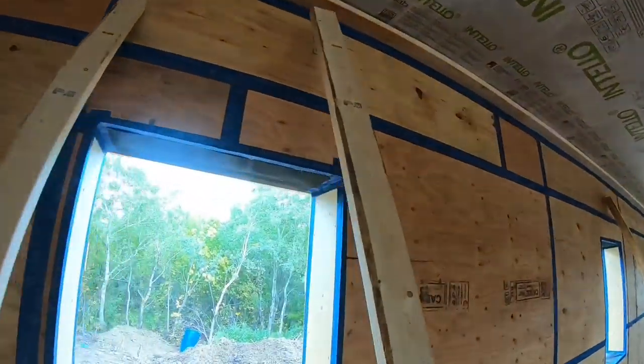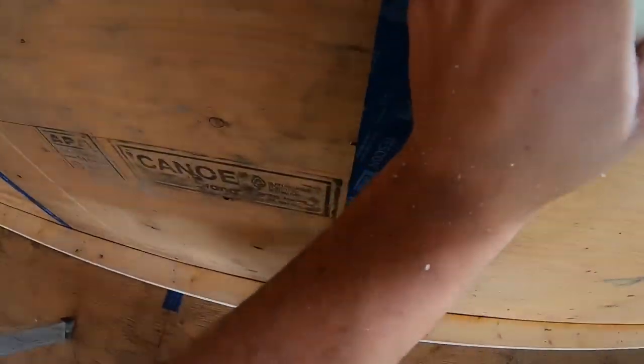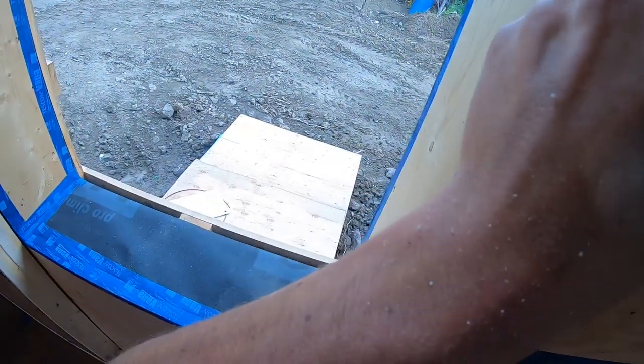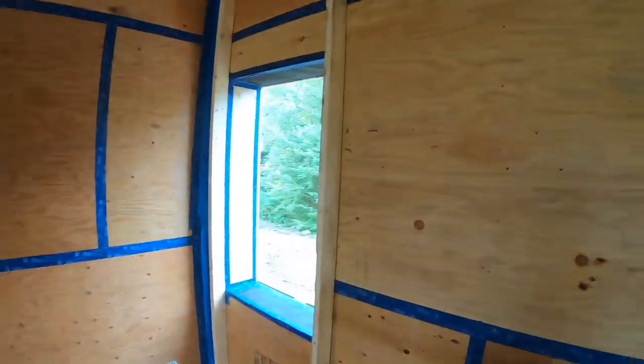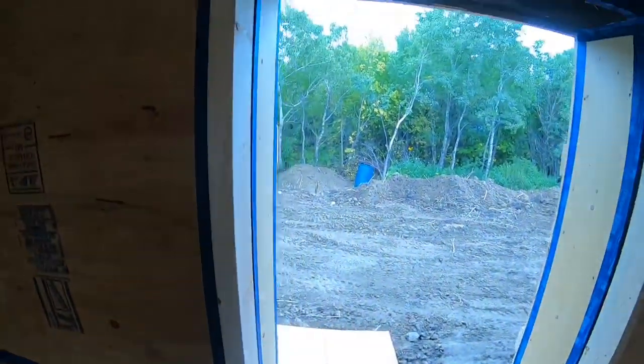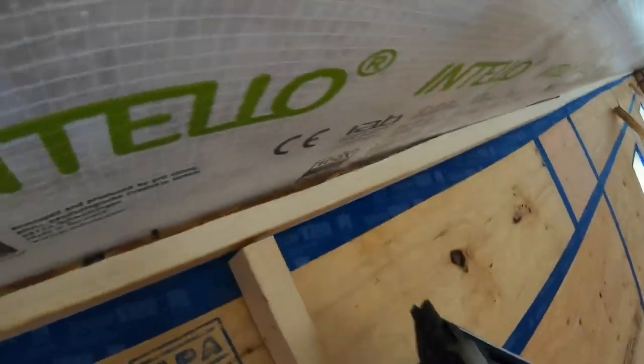For the studs we start with putting the sides of our windows on first and then laying out two-foot on center, just to see where everything ends up in relation to our windows, and making sure none of the studs we put in on the interior cavity line up directly with the ones on the outside walls. I just line these up, framing vertically — it's just easier to toenail it in place. Framing these walls on the floor and standing them would be a lot more challenging trying to take measurements of the window. This way you can just set it right up against and get it perfect.